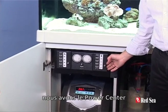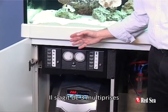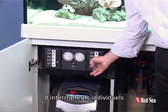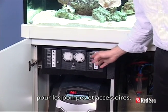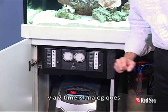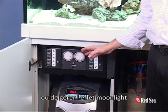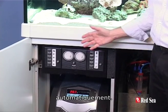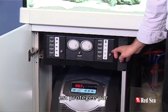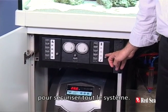On this side we have the power center which controls all of the electrical equipment inside the aquarium. It consists of three banks of outlets. Two of them are individually switched units for all of the pumps and accessory equipment, and this one is controlling all of the lighting and includes two analog timers which enable you to have a sunrise-sunset effect as well as switching on the moon lights automatically. Each of the three banks of outlets are all protected by their own individual automatic circuit breaker to add another level of protection to the system.